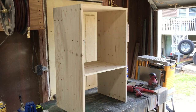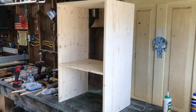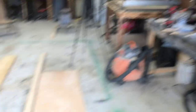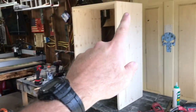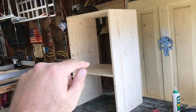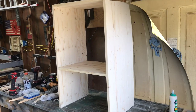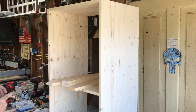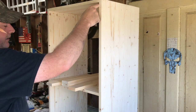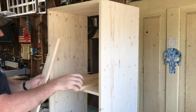Here's the beginning stages of the Keurig stand. Down here is where the dog bowls are gonna be, and I'm gonna cut that thick 2x10 to make the top. Now I'm gonna measure the opening and frame out for the door with the 1x3s. The opening worked out to 20 inches each way — that worked out pretty good.